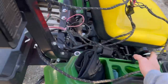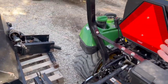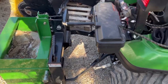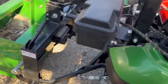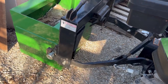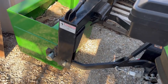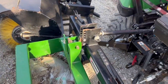Tip of the day: you've got a quick attach unit and everybody gets off and opens these all the way up from the seat to unhook it. Well, there's no point in doing that when you're hooking up — that's what it's spring-loaded for. You just pick it up. It's spring-loaded. I don't know why people are getting off and doing that twice. That's kind of the point of them being quick attach.